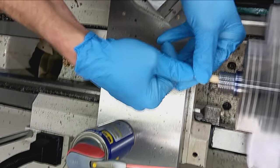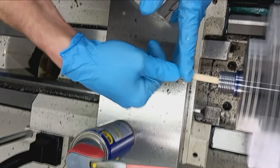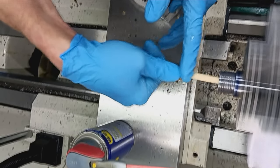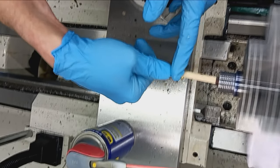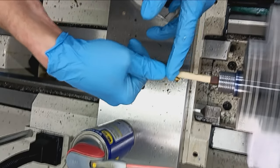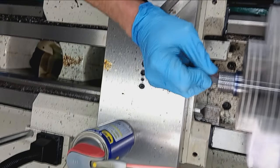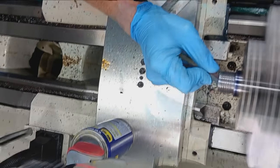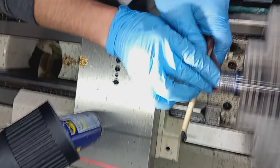And I'm stopping at the shoulder. I'm not going over the ramp into the bore. So I don't want to mess with the throat area or the transition of the rifling. Come down, do the cone a little bit. And then of course it makes all the visible surfaces really nice and shiny.